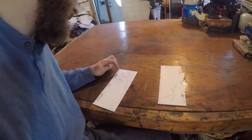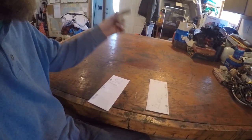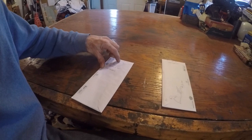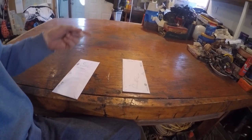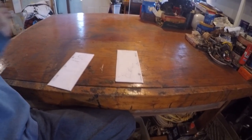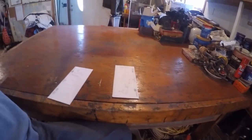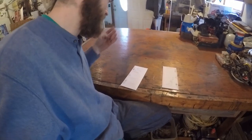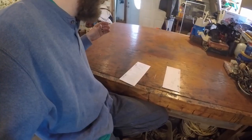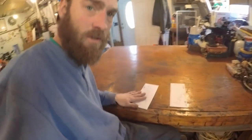Then I came up with this other idea for an air wheel. Basically, I'm going to have some kind of device turn, probably just a disc, maybe a piece of plywood, and I'll cut a slit that's, instead of just a circle, almost like an oblong oval maybe. We'll seal it up and blow air from one side, and as this wheel turns, it'll either block the air or all of a sudden allow it to open for a second, and then the air will be able to go through, and that air will be forced through a tube into your lungs, for example. So basically we need to make something that pushes air and another thing that controls the amount of air and how often you get it, to give you approximately 500 to 600 milliliters of air per shot. Okay, now how do we do that?